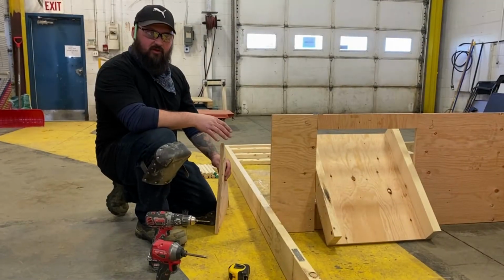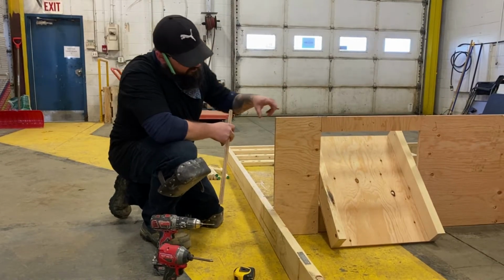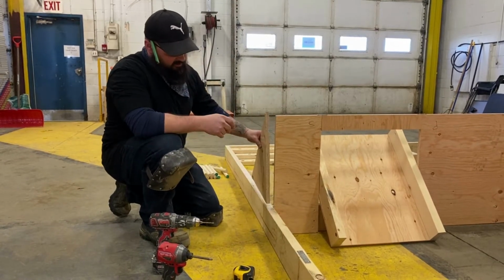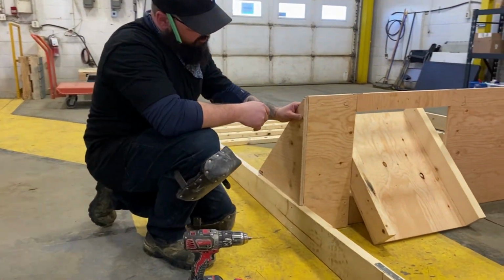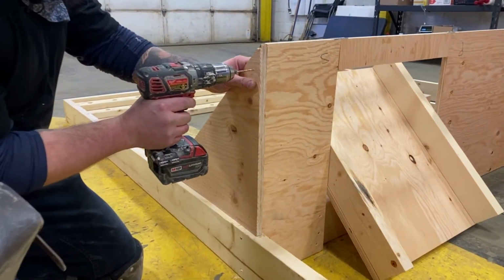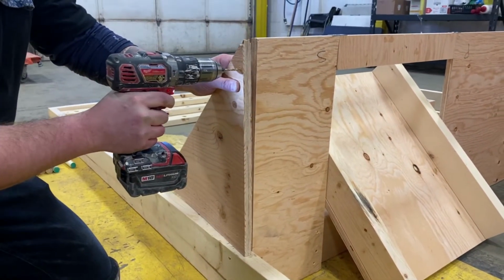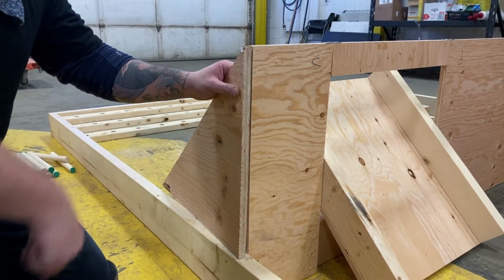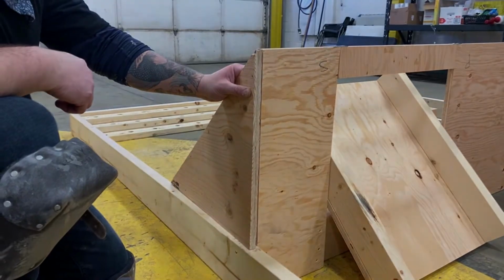The last portion of the framing of this build is to assemble piece T against piece S. To do this, we place it on top of the 2x6 side piece, and we just press it up against piece S. I suggest using some pre-drilled holes before installing the piece with the 1¼ number 8 wood screws.